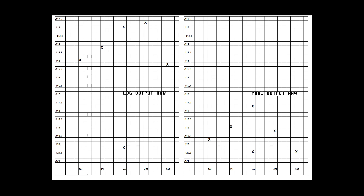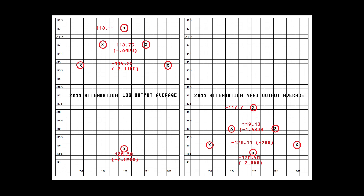Here are the results of our test — again you can see the body's effect on signal measurements in the raw data. One thing immediately clear is that our log periodic from a terminal gain standpoint is superior to the Yagi in this test. The match of the Yagi at system output frequencies is not good as we saw earlier, and this is playing a role. So the next time someone tells you that match doesn't matter in a receive role, you can see the evidence to the contrary — there is almost a 4.6 dB increase in terminal gain over our Yagi.